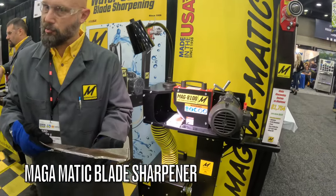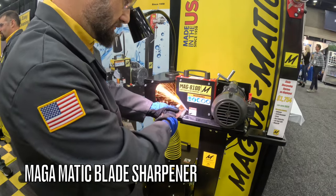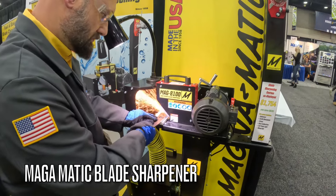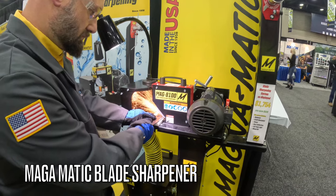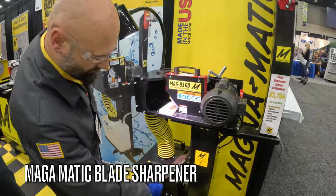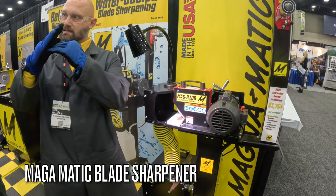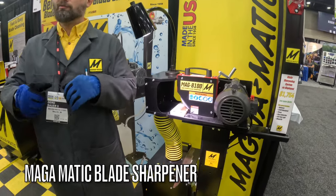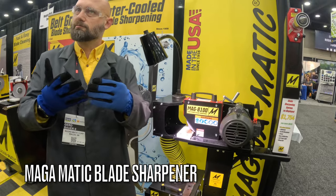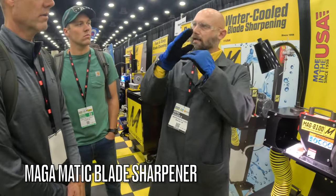And of course, we're referencing our angle off the underside, so you have to stay flat. You cannot lift up the blade, right? With a grinder or any kind of freehand situation, you're always changing the angle, so you're chewing up more of the blade than you otherwise would have to. Whereas if you keep the same angle all the time, you're removing the least amount of material in that angle.